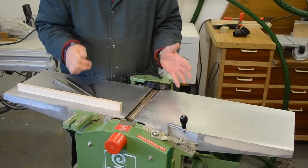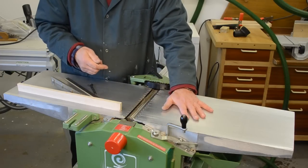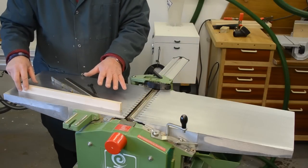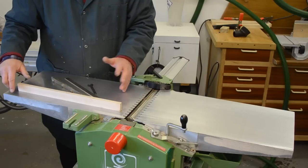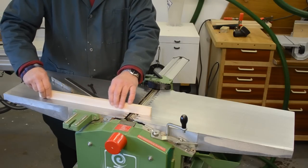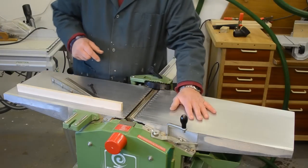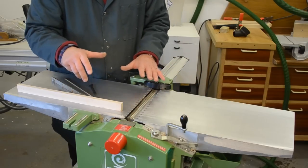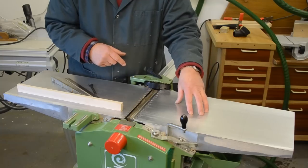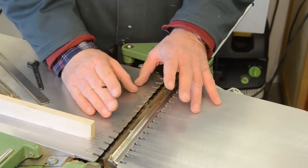I want to just point out the important parts so you'll understand what's going on. This is the so-called fixed bed, and the one on this side is adjustable for height. In this setup you would be using it for surface planing, or jointing as it's called in some parts of the world. The adjustable one can go up and down so you can dictate just how much wood you take off in each cut. Now the so-called fixed bed actually does get removed when you turn this machine into a thicknesser.